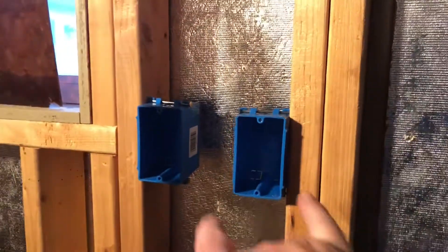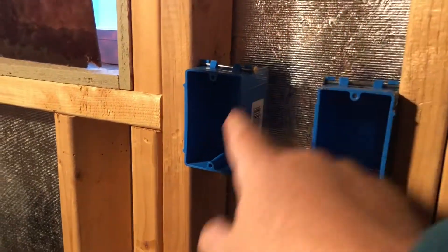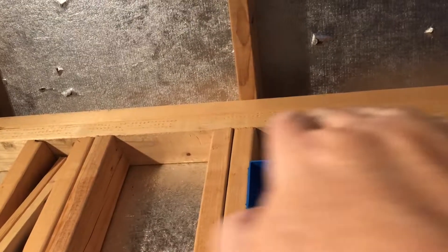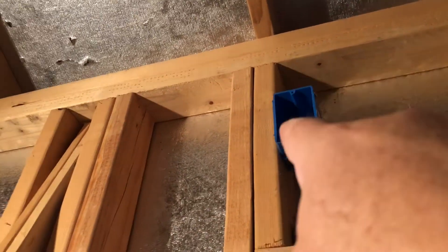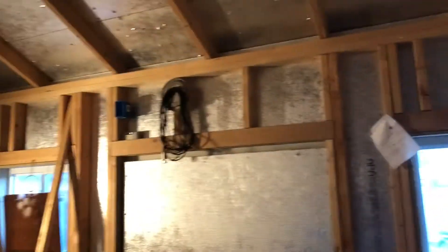Anyway, this is the door. Right by the door I have two switches. I'm going to have one switch go up to all the lights, and this one will go down. This switch will go to this outlet up there — that's near the top of the wall. This one will also go to the one up here, and that one up here. So there's one at the top of each wall, roughly in the center.